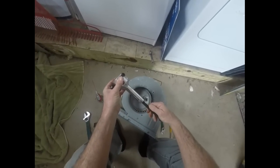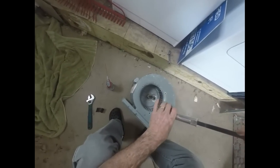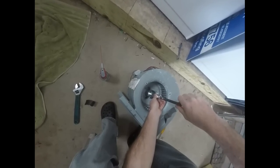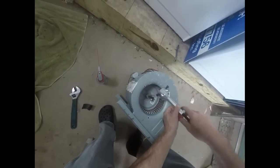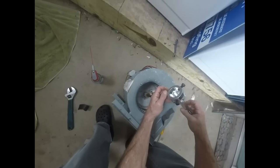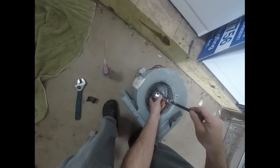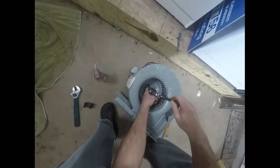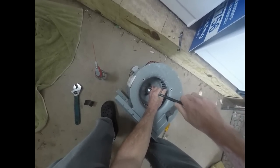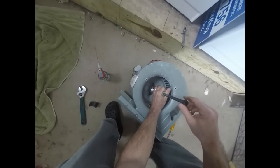You can unscrew the bolt here and you fit it down on top of the motor and the shaft. You want to make sure that when you do that it goes all the way down. Remember we took that bolt out of the hub and it's right here — you don't want to get one of these bolts screwed into that hub. So when you place this on there you want to make sure that the bolts on the puller are not lined up with that hole. Then you simply tighten these down, fasten them securely, back up with one wrench right here and start to crank this shaft and it will slowly push and pull the hub off of the wheel, or the wheel and hub off of the shaft. And that's how that works.